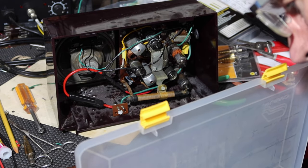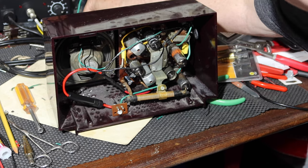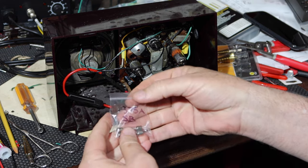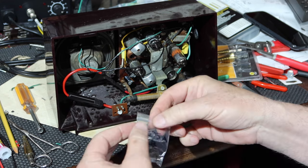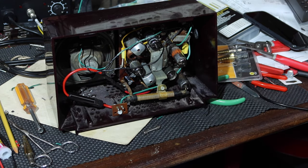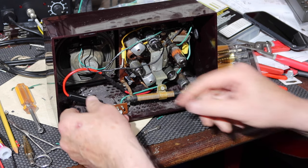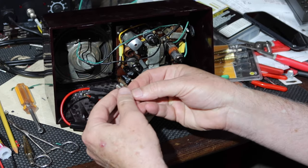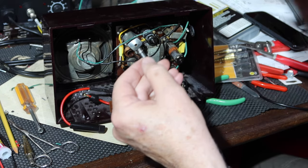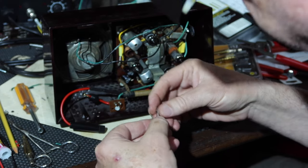I come out of half amp, so I've got some 3/8 slow blow. That'll be fine. If I need to go to half amp, I've probably got another problem. I have to find out what it is. With that CL90 in there, I'm going to be surprised if I have a problem, because it'll definitely be controlling the inrush. Okay. Sure. Yep, 375 milliamps.